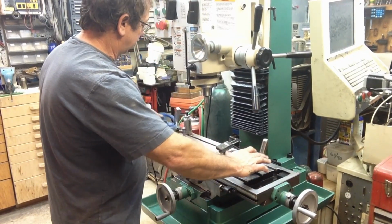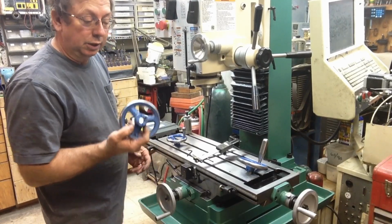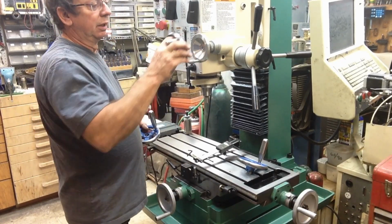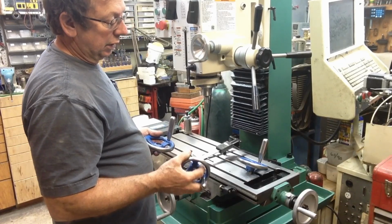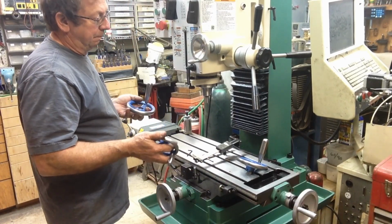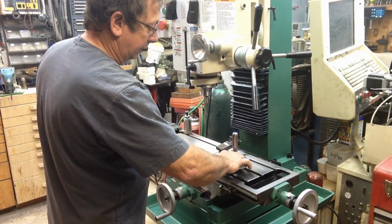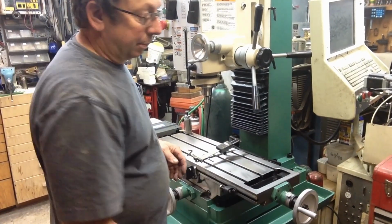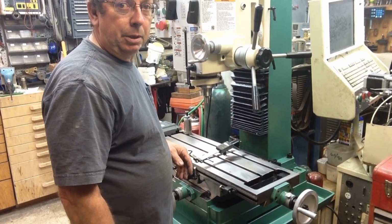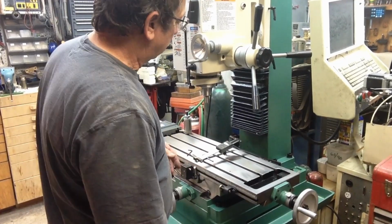The Y-axis is still in the original setup configuration. It's a little bit small for this shaft, so I'm going to have to open up the bore in it a little bit. And same way with the Z-axis, I'm going to have to open up the bore in there to fit on there. The hand wheels are virtually the same size. They all weigh about the same with the cutouts on these and the cast iron handles there. I haven't weighed them, but they're awful close to being the same weight as the original steel handles that came on the 0755 here. That's going to be one of the projects I work on this afternoon, probably off camera. I'm going to fit them up, then tape up the polished parts, go to the sandblaster, sandblast them, and powder coat them. I've got some green that will kind of match this. I'll just go ahead and powder coat them up and it'll be fine.